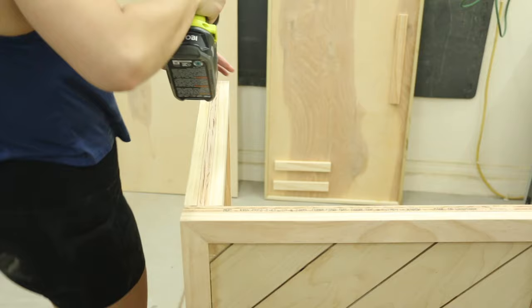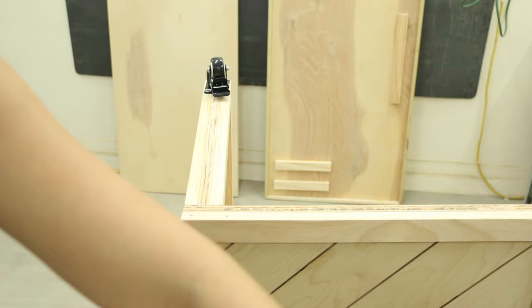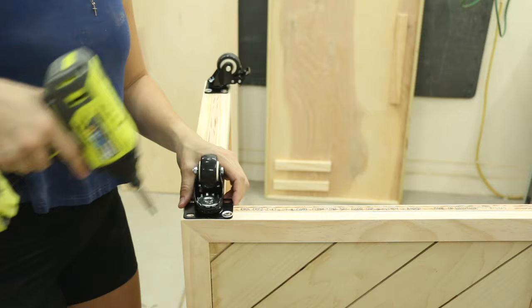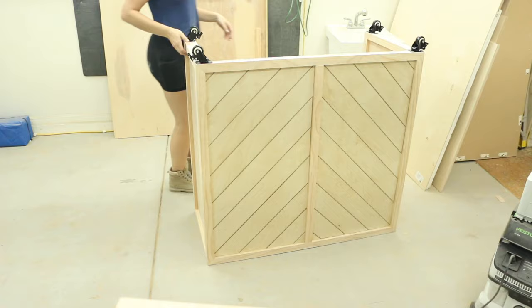This bar is three-quarter-inch plywood with one-by-two framing on basically every square inch — it is a beast. So I ordered these two-inch casters off Amazon and they fit the width of the panels perfectly. I love casters and I'll put them on basically anything I build, but always make sure you get the full-swivel locking casters, that all four of them lock. It came together so nicely.